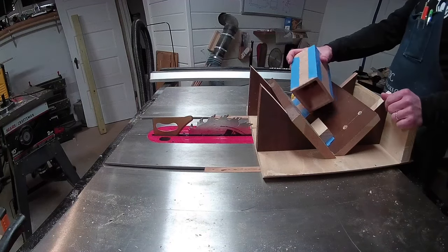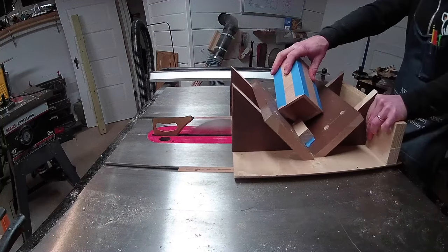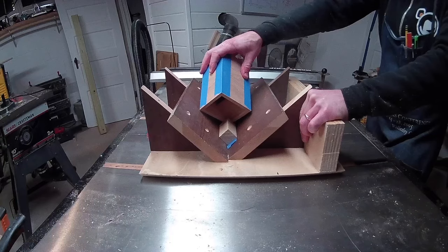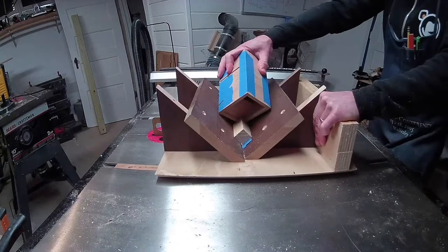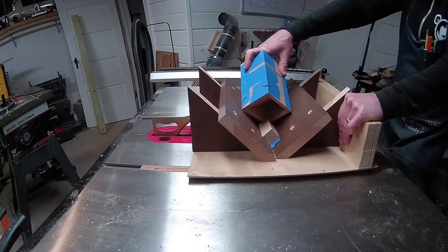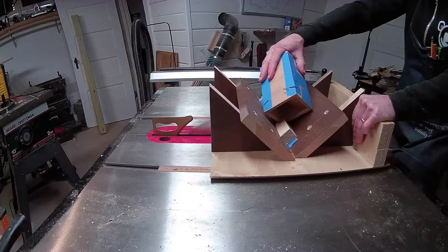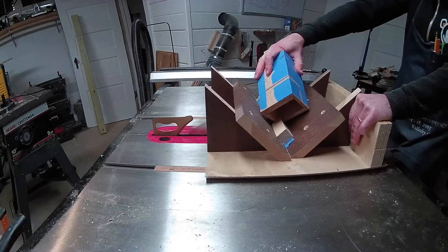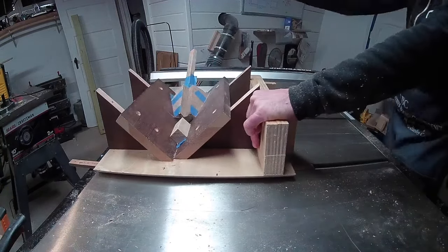For the second tower, I wanted to try something new. The contraption mounted in the bottom of the spline jig causes the slot to be cut at a 30-degree angle. I'll use splines that fit a single kerf on this one to avoid the process getting too out of hand. I could have tilted my blade to 30 degrees instead, but I make a lot of picture frames using this jig and I didn't want to risk ruining the zero-clearance 90-degree slot.